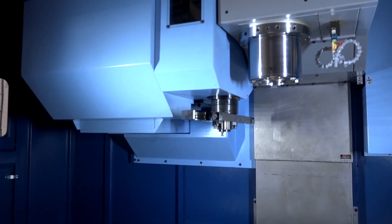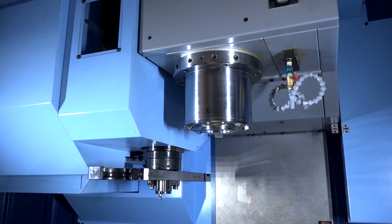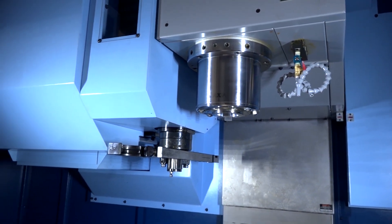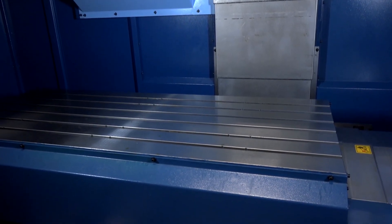And this is now a BT50? This one behind is a BT50, also available with BT40, both with 15,000 RPM. Do you also get a bit of power with the BT50? The Maxia spindle — they're very sturdy, very well-built, durable spindles. It follows the same specification as you'd have on maybe the horizontal H Plus 630 and also the MAM 72 63V with the BT50.